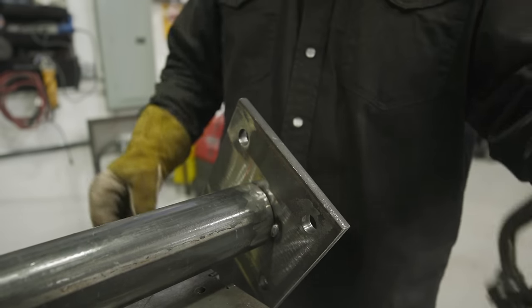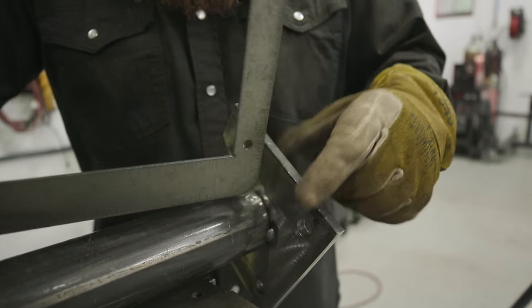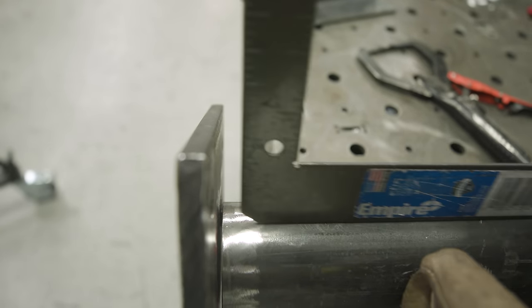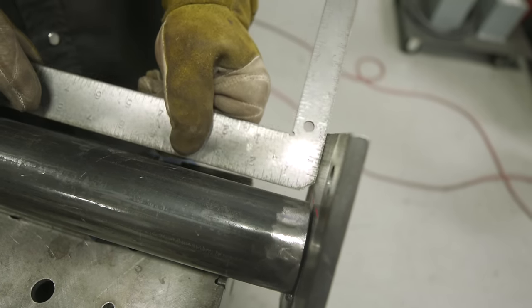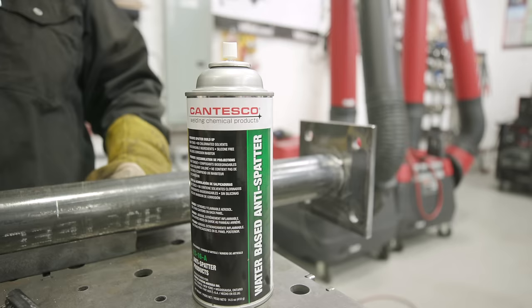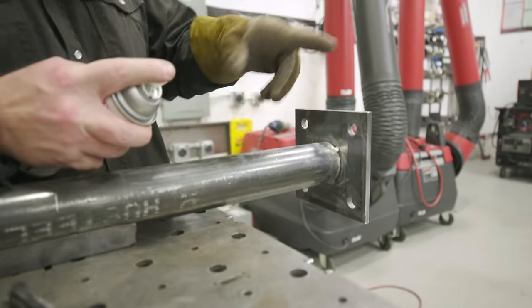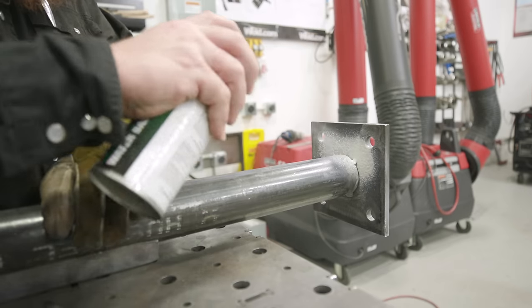Now I'll take my clamps off and double-check everything is square. We cut a notch out of the square so once we get that weld on there we can still double-check it. Both sides look relatively square, so I'll go ahead and tack it, double-check again with the square, put two more tacks on, and then do the weld out. Any time I'm doing short-circuit MIG I like to spray some anti-spatter on the workpiece - it gets rid of the BBs and makes post-weld cleanup a lot easier, and it doesn't interfere with my weld.